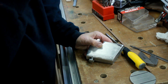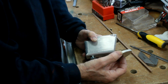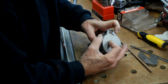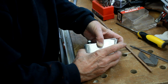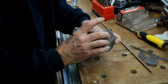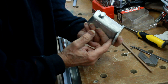So I've just checked with my welder man, and he says he can TIG weld aluminium. So I'm going round and round in circles, here we go, back to going with the metal plate TIG welded onto the actual stub axle, and then the steel plates on the centre part. Then I'll just drill 2 holes through and bolt those together with a couple of bolts, and I think that should sort me. So at least then I'll have a TIG welded joint all the way around that plate.